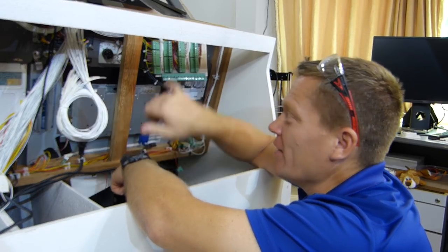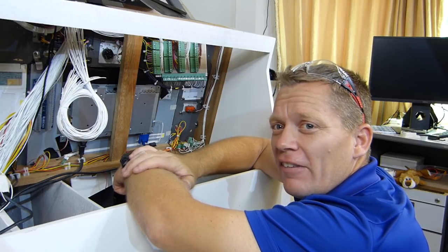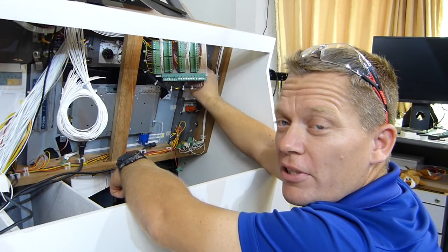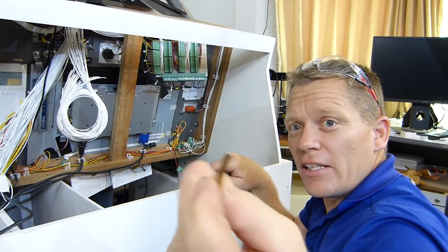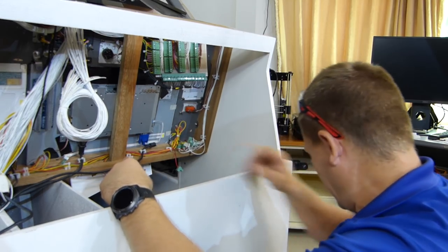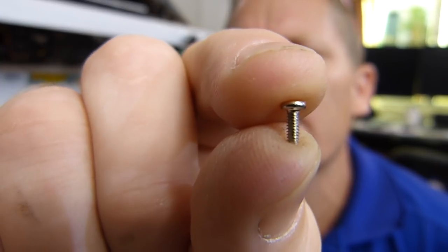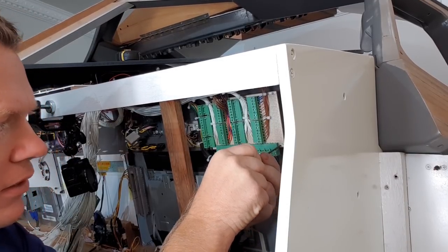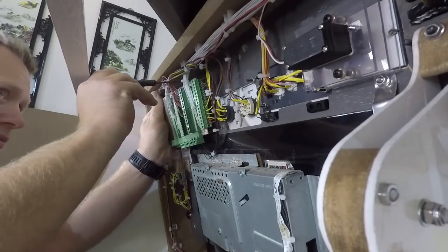While I'm here, it's probably a really good opportunity to try and get these breakout boards mounted back onto their stanchions. However, they are the tiniest little screws and I have absolutely no idea where they went. But I could unscrew one of the stanchions and see if I can find eight screws to put the left and right breakout boards in. I've managed to find some tiny two millimetre screws — just one in and it goes nice and secure. Board number two done.